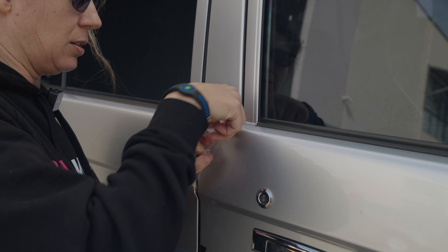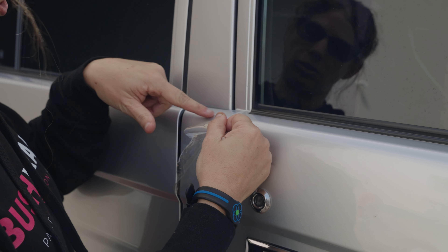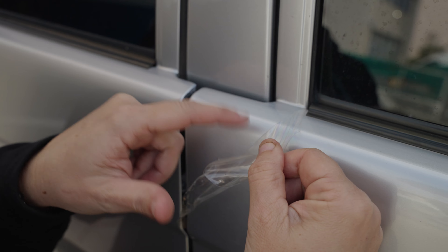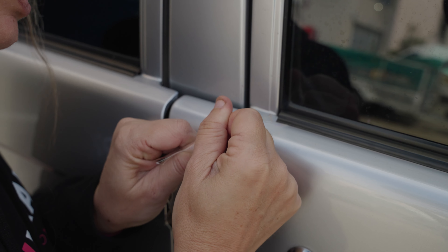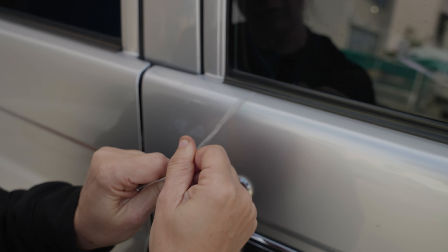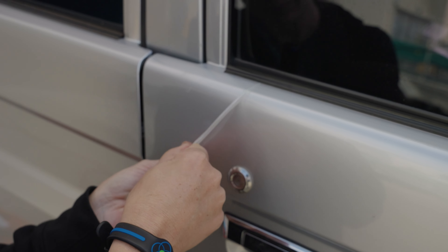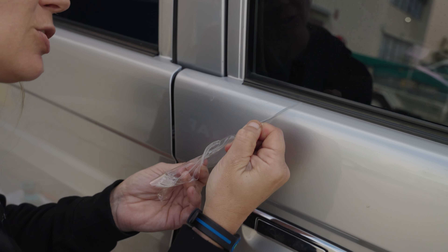I can see here it pulls straight up. If you pull sideways — just to show you — as I'm pulling normally, I'm leaving a heap of adhesive there. So the trick is to pull outwards, and that will make your cleanup a lot better. I've got no adhesive there at all. And up there it's going sideways, so I'm getting adhesive at the top.